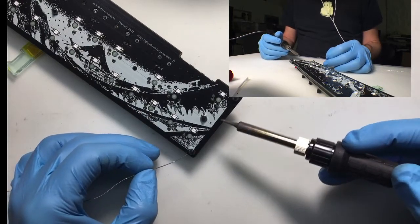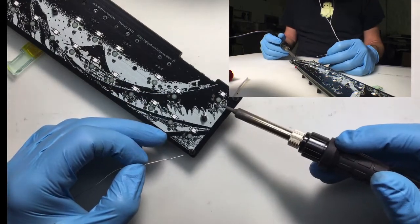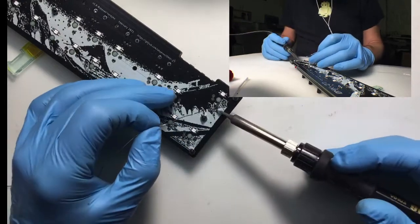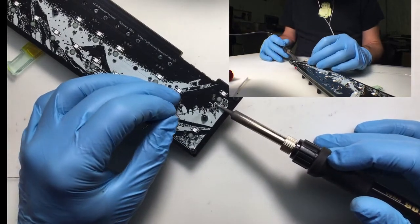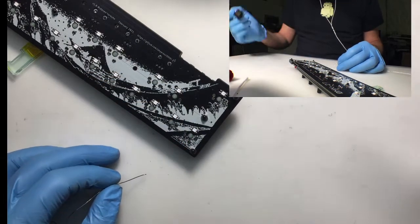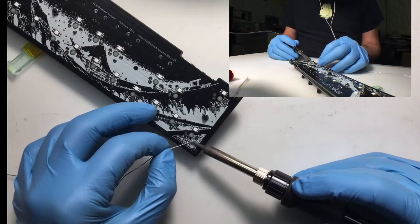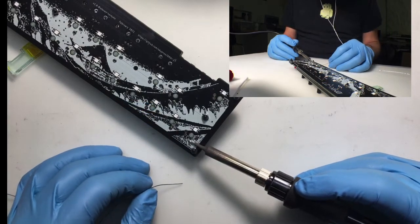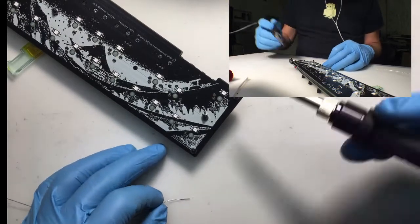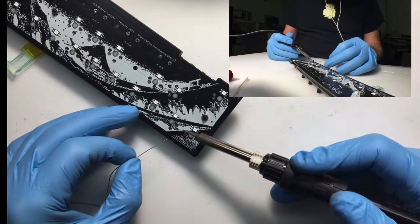Another tip here is you want to be pretty quick with this switch soldering because you don't want these pins to heat up crazy amounts and get hot on the plastic of the switch body. So you just want to kind of heat up, 1, 2, 3, give it a quick little feed, give it another 3 count, 1, 2, 3, and hey, look, it's done. And that might even be overkill if we're just going to tack these first, but I think everything looked pretty good, so I can just kind of go with it. If it looks like it needs a little bit more solder, just give it a little dab. These don't have to be filled, way mounded up full of solder, just see what you got.